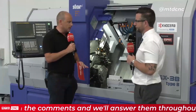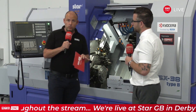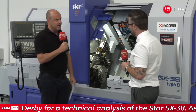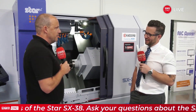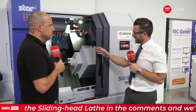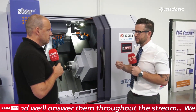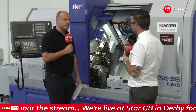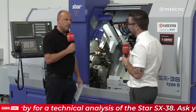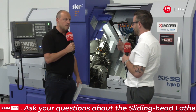Keep your questions coming in — Gio and Chas are coming up very shortly. B-axis: how important is it on a machine like this, Matt? Seeing it in action really does open up opportunities. It goes back to what you said about prismatic parts — this opens it up massively from what you can actually do. The B-axis can be used on the main spindle and the sub spindle as well. It's supported top and bottom so it gives that rigidity, it's programmable, and you've got four power tools on the front and the back so you can do crossover work at the same time.